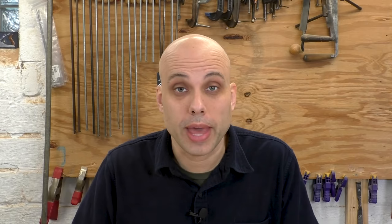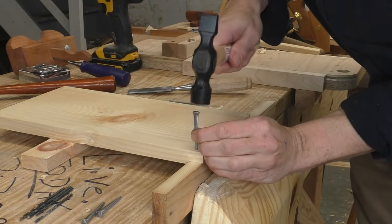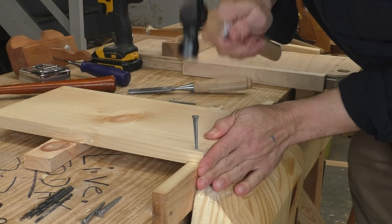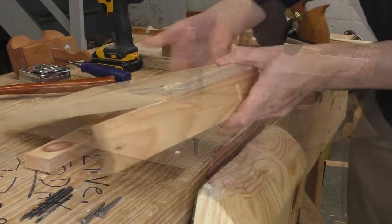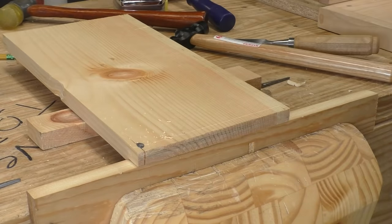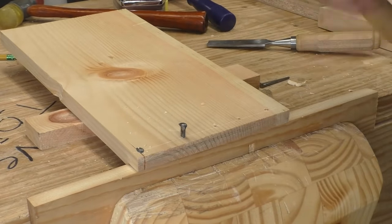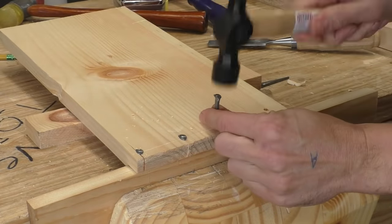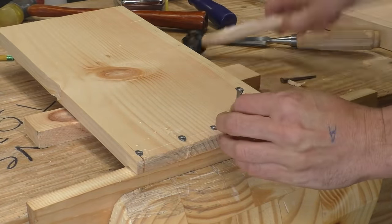The most important thing about using nails in your project is testing them out first. I've got my rabbet joint cut in this scrap wood, plus four nails and four drill bits. You drive these rectangular nails with the wide part going along the grain, and this causes them to wedge in place with incredible grip. But you can't just drive them straight in — they'll split the wood. Instead, you need to experiment with different diameter pilot holes, especially through the top board. The nails I bought ended up being a little too big, so I also needed a small pilot hole in the bottom board. This is why testing is so important — I've figured out all the details here, and there won't be any nasty surprises during assembly.